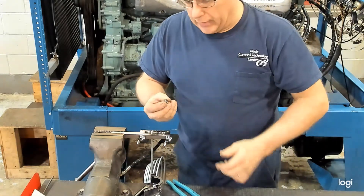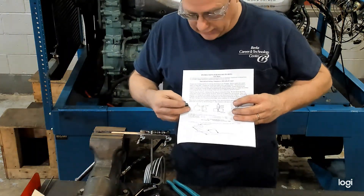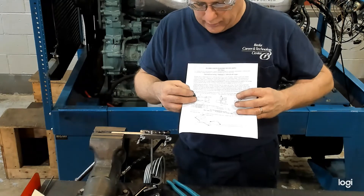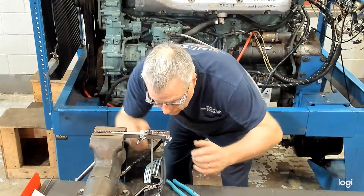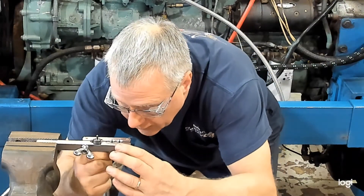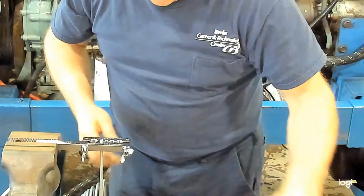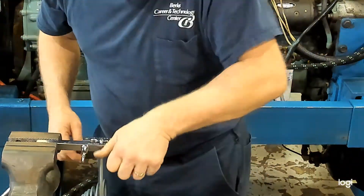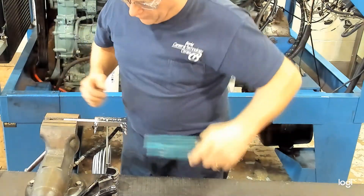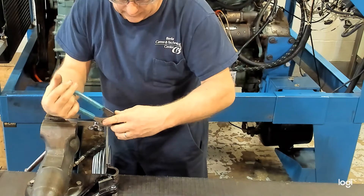We're going to place the tubing into our split yoke in the quarter inch opening — remember we've got the numbers and the taper on the top. We're going to set the height, then get our button — the small quarter inch button. Using the instruction sheet will help us set the height. There is a ridge in the middle of the button that is the height setting for our tubing. We'll loosen the wing nuts just enough so we can slide that down and make it level at the top, then tighten by hand. We want to go no more than a half turn more, and we'll tighten the wing nut closest to the tubing first and draw it closed.